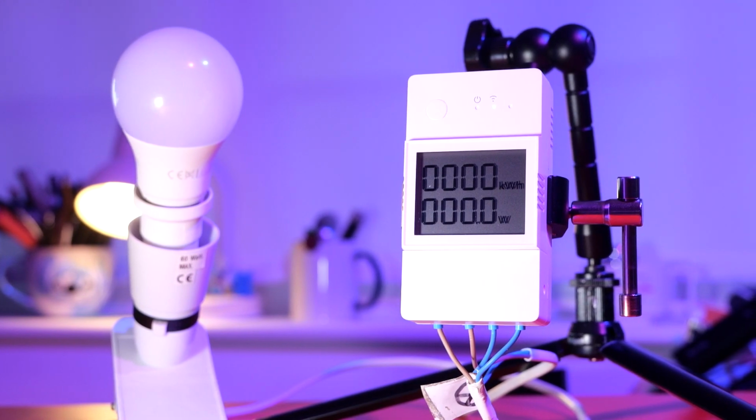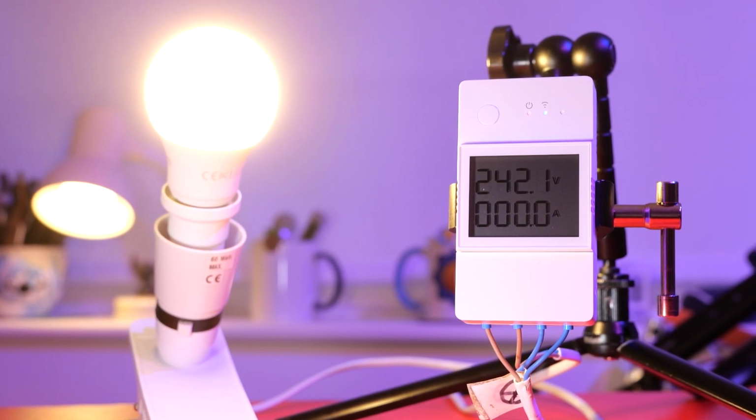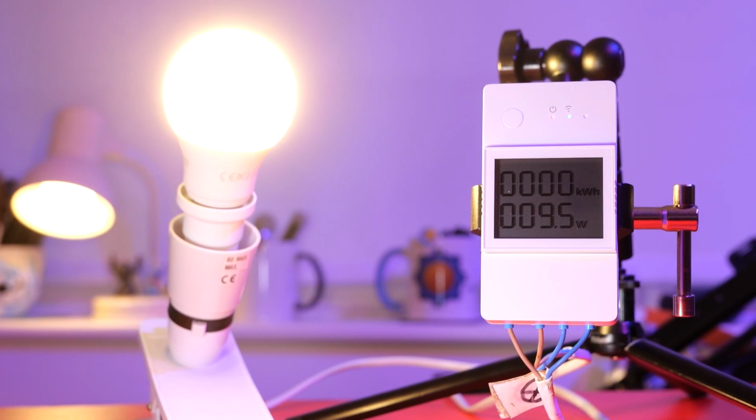And while we're talking about the features, there's something I should mention about the power metering and logging. Now the device is capable of delivering a very steady input of data. Every 5 seconds you're going to get information on what's going on, how much power your target device draws, etc. However, eWeLink Cloud allows you only to log average output over an hour, which means you're not going to store all that frequency of updates on the cloud. You'll have to figure out another way of doing it, which is slightly annoying because an hour frequency is all you get from eWeLink Cloud. I reckon for many of you that's going to be a sole reason to actually flash this with Tasmota and get a little bit more granular control over it. I wish the people responsible for eWeLink would change that slightly so you could have access to more granular information for, let's say, a week. After that it would get aggregated and available in 1 hour installments or 1 hour frequency periods.